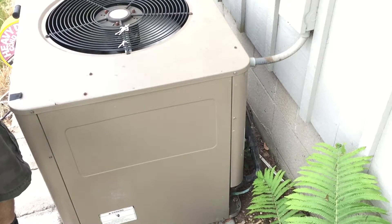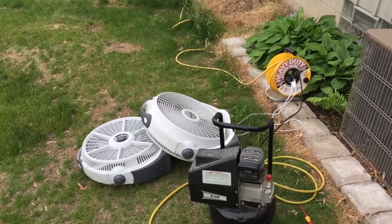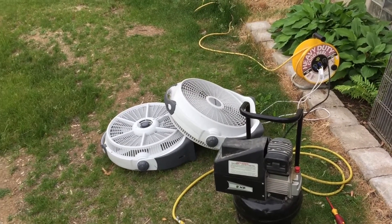So now I just need to clean up and go inside and enjoy the air conditioning. The air conditioner went down on Saturday. I ended up taking a 35 microfarad capacitor out of a compressor motor I had, ran it, and then used the fans. Two days later I finally got the correct capacitor. Now the fan is running and the compressor is running — everything is doing good. It's just like my snow blower: don't give it any type of preventive maintenance until you need it. That's going to do it for this episode of What's Next Garage, Hot and Sweaty Edition. Thanks for watching — like, share, and subscribe, and have a great day.